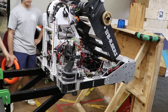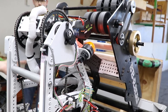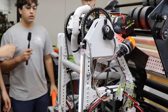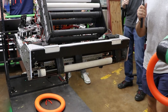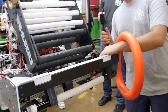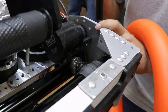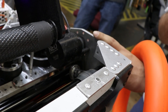Something very important to us was keeping it simple. By having that one degree of freedom, we were able to keep shooting into the amp really simple. Going more into the general design of our intake — we knew we wanted a 26 by 24 frame without the under-the-bumper intake, and we wanted that full-width intake since when you're intaking notes you'll be all the way across the field. What was important to us was centering into the shooter. This piece right here is our bearing centering piece. We saw a lot of teams posting on Chief Delphi about experimenting with bearings, but not many were finding success, so we decided to try it.